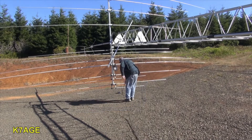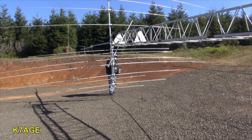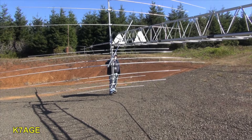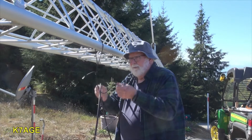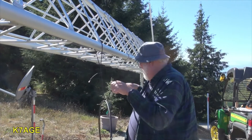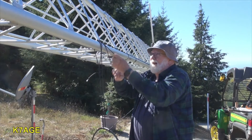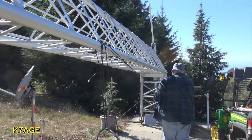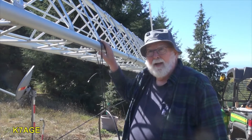Getting your lines fed properly so they're not crossing over or getting tangled up — that's the 80 meter, and the 40 is out here. I'm going to connect the 40 onto the 40 meter balun. I'll probably take this back off and take the coax into the garage to put the other end on, so I'm not doing any sealing for now. Now I'm going to hook up one of these black lines that I use to pull the coax up to the tower. I have this line tied off so it'll pull the coax up and run down the tower. I'll unspool a lot off the gator, cut it, and wind it back later. Got it tied back off down there at the tower.